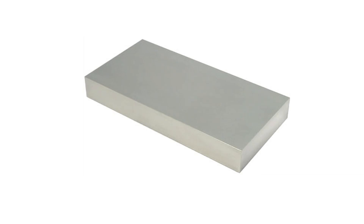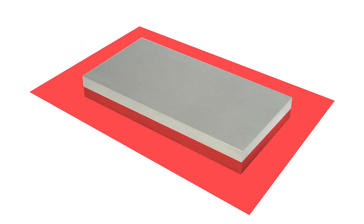So if you're making your own, or you have a part that overhangs, you can. You will get chatter if you're hanging out beyond 16–18 inches, probably around 14 inches on the narrow side. Finish passes is where you do all the cleanup. If you're taking aggressive cuts far from the base — oversized part or pallet — yes, you will see some chatter because of the overhang, the cantilever nature of it. But a good finish pass will clean that right up, so I wouldn't compromise there.